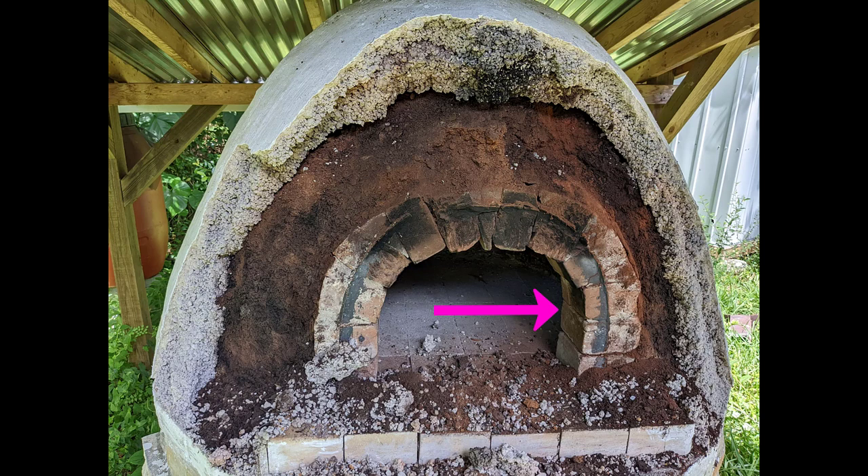There's the brick arch, and above or behind that is the cob dome that stores all of the heat. Then there's insulation — a middle layer that's kind of like a fluffier version of the cob mixture with wood chips and other stuff to make it light and fluffy. That's a really thick layer that goes on top of the dome. Then there's another insulation layer I added — a perlite and porcelain slip mix — and that's what you see on the outside. The very outside is a hardened shell of lime plaster with lime wash coats on top. You still need a roof structure even though it's been coated with all that, but it all held up really well.